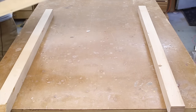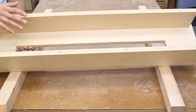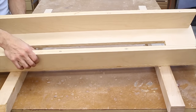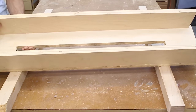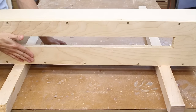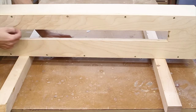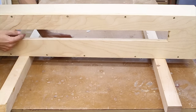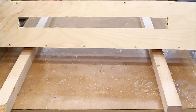You're also going to need to make a little cradle for your router. All this is are three pieces of plywood. The rails on the outsides are four inches wide and three feet long, and then the bottom piece is eight inches wide and three feet long as well. There's a slot cut in the bottom for the bit to go through. My jig here is 25 inches across, and the slot is offset because the bit in the router base is offset as well.